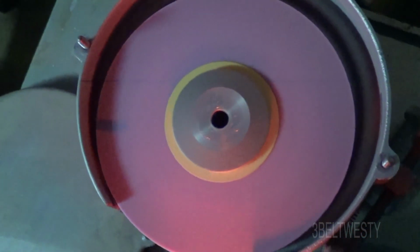You got the vibrating reed. And if I take over here with the control handle and I vary the speed, you can see the reed there going back and forth. The reed vibrates to 60 hertz of the power company. Let's rotate this around so the reed doesn't move. See, if I go real quick, it's way off. Get right to sync up, no motion, and there's the disc slowly precessing around.